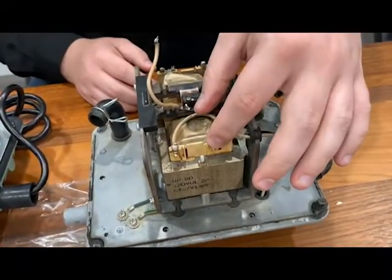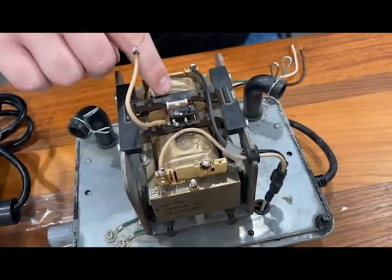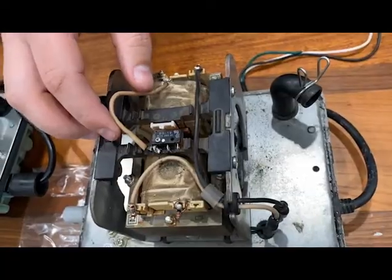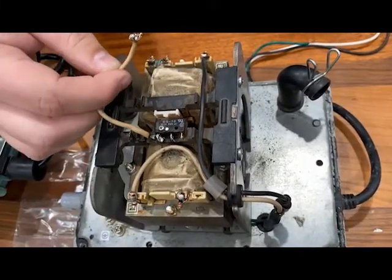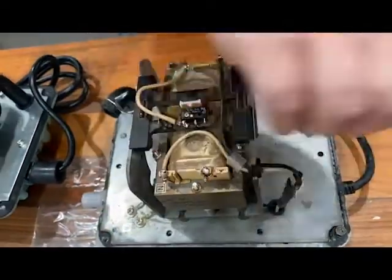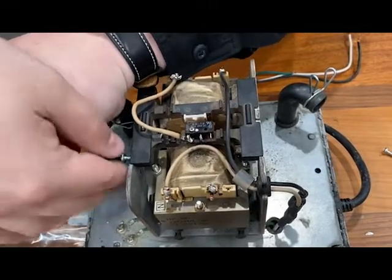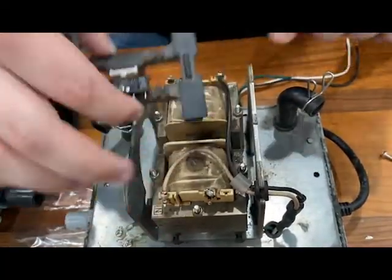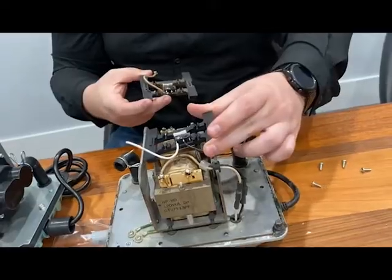This wire was damaged, so we don't have that wire anymore. We can look at how this wire was unsoldered. That connection is already made — we don't need to get rid of that, since our new unit will already have those connections made for us. We'll undo that wire and then unscrew this. Now that we've got all those screws off and our wires unsoldered, this will come up. Now we can put our new assembly on there and we'll be able to solder it up.